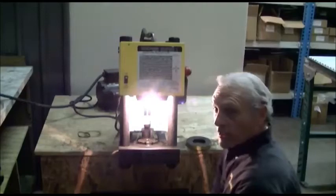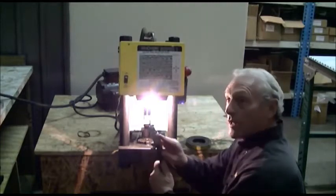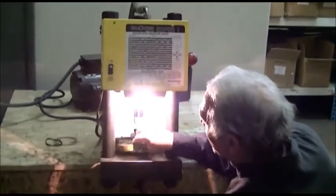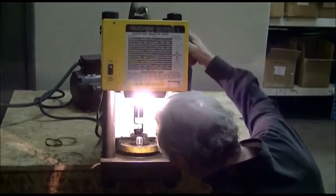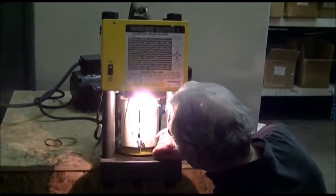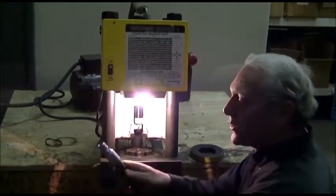This is a positive stop Weatherhead 410. Notice it has the arm back here. We're getting ready to crimp the Weatherhead coupling. Okay? 1/2 inch dies inside. Put it up, put the yellow plate, flat plate down. Now here's the Gator.